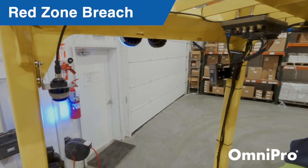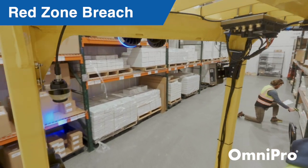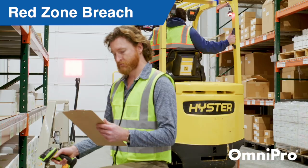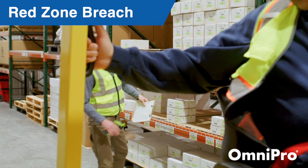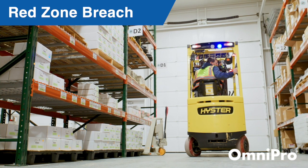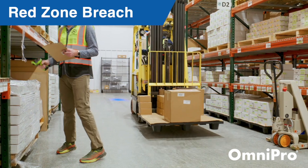Red zone alerts are the most serious because the pedestrian is now too close to the vehicle and in imminent danger of being hit. The hub activates a red zone alert, which usually is a red light and an audio alert. This tells the operator to immediately stop until they can identify the location of the person. When they are clear of the red zone, the alert will stop and normal operation resumes.